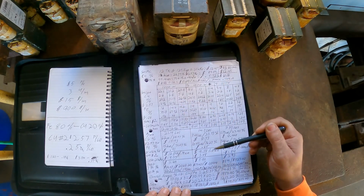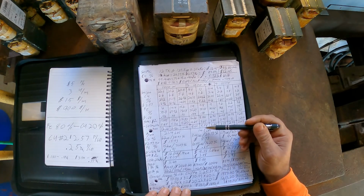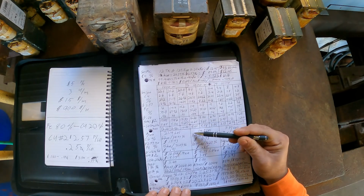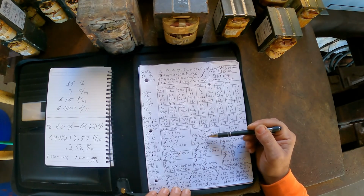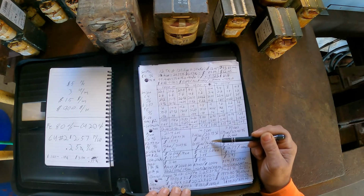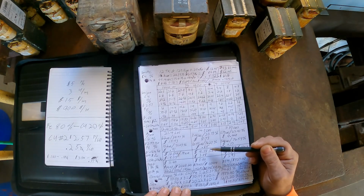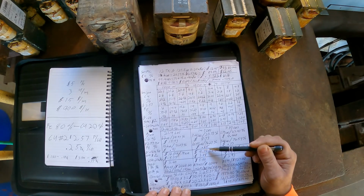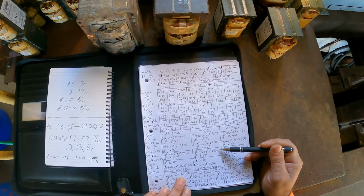This is the average of the thousands, the average of the 400s, and the average of the 100 watts. So on average, they were 14.3 pounds, 3.4 pounds of number 2 copper at 23.73% at a market value of $8.73. The steel, 10.93 pounds, 76.27% at a market value of 65 cents, for a total processed value or profit, if you're getting them for free, of $9.38 per unit, and that comes out to an average of 65 cents a pound they're worth.